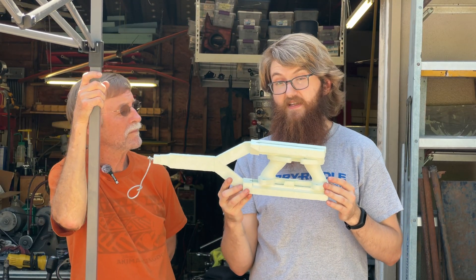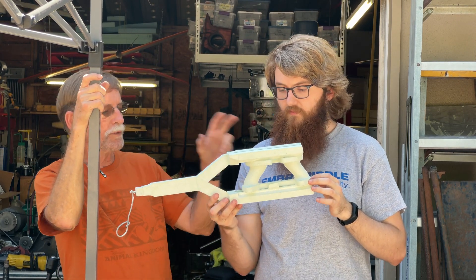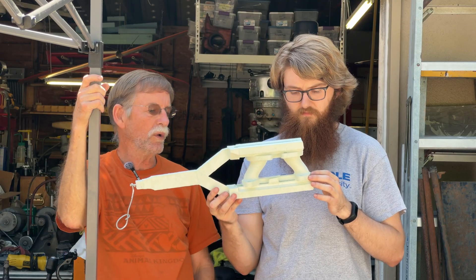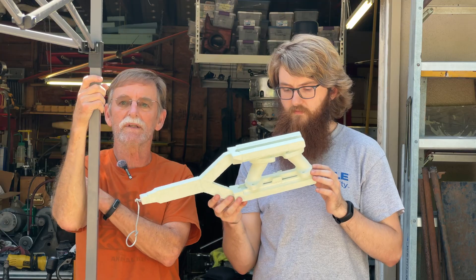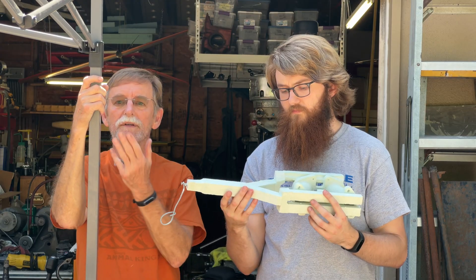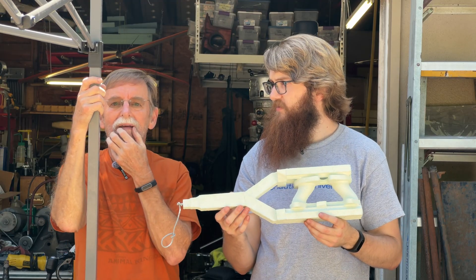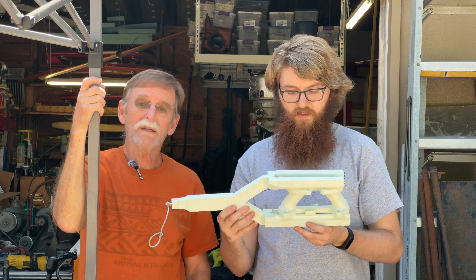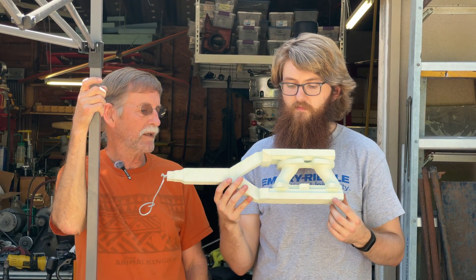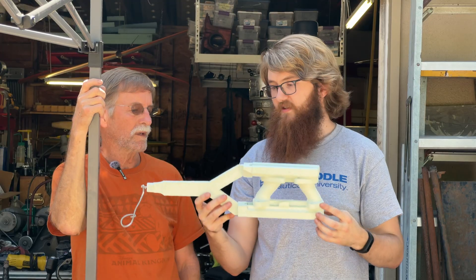Technically this is just a test, because it may not be scaled correctly. We'll take measurements on center-to-center of the mounting holes and the top and bottom mixture holes to see how that relates to the drawing. If it's off, we make corrections in the print and do another one. We've noticed some oddities with the printer not printing to scale — only certain features, only sometimes.